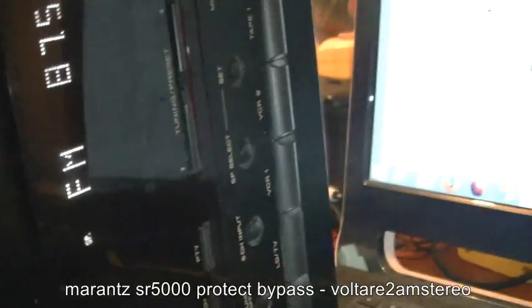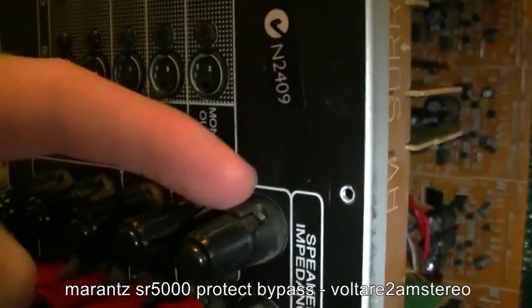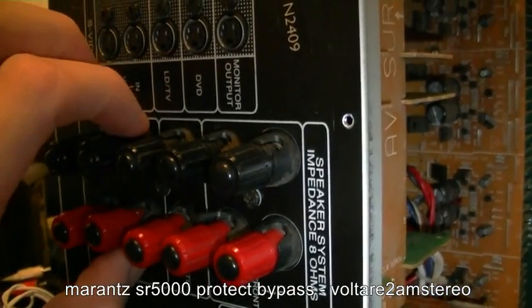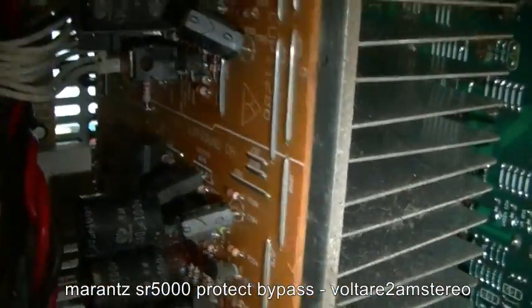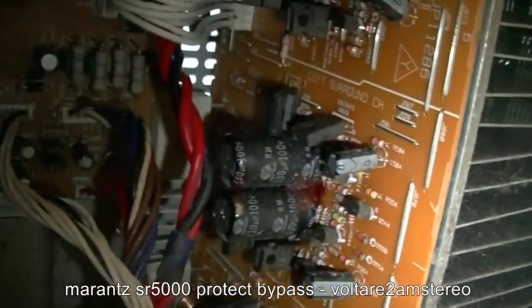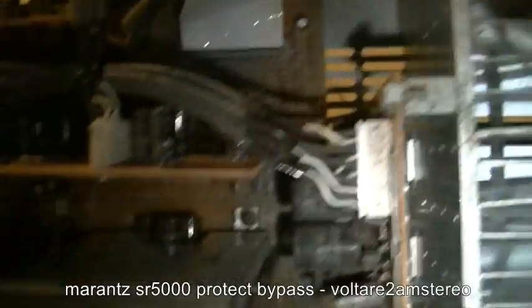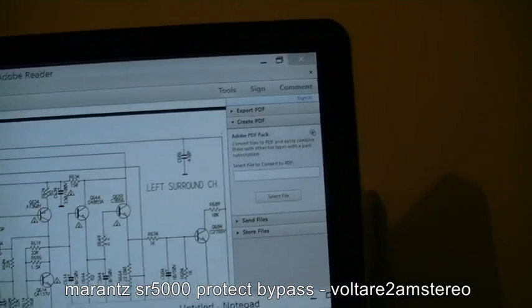Now, the failure on this wasn't purely or really an amplifier failure. What's happened is this unit's been dropped. This back casing was caved in. So these two connectors here, which is the rear left connection, were shorted out, which inadvertently took out both the output drive chips and the two feeder chips. So now I can either leave it like this and just run it as a straight 2-channel amplifier, or I order the replacement parts and that'll get us back up and running.